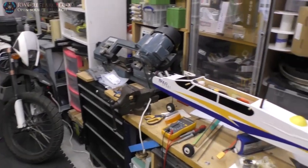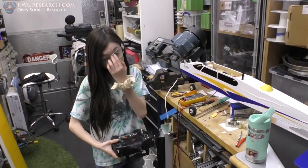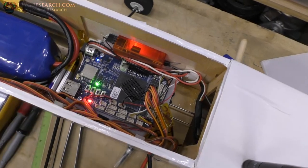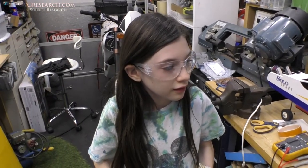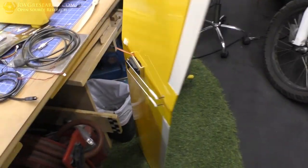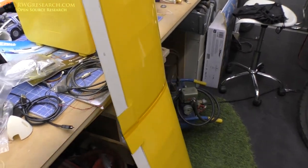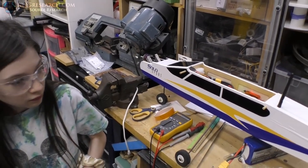That's cool — you literally have a working airplane. There's only one major thing we have to finish: I want to get the battery data. We have no battery data. I want to get the battery data from the CAN bus, which I wired up. I can read the data — I just need to figure out a way to get it into ArduPilot. The other reason we had to clean up all that wiring is because on the backside of the wing this thing sticks down, and that takes up quite a bit of space.